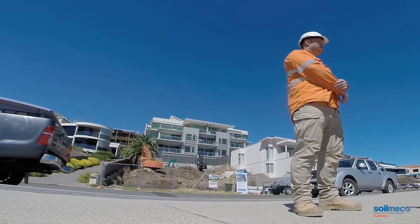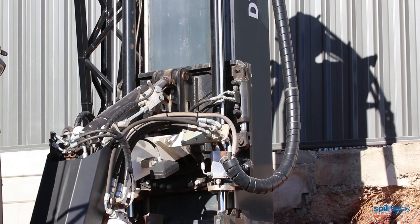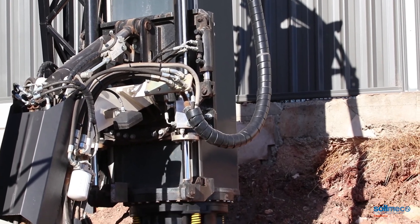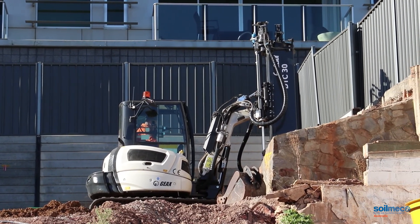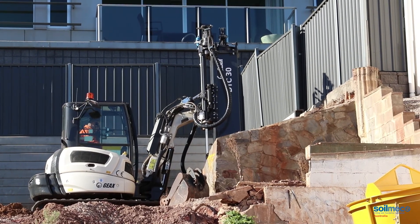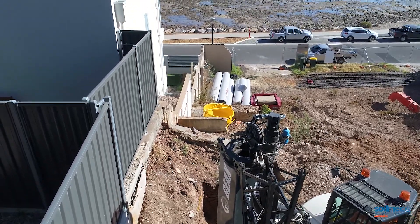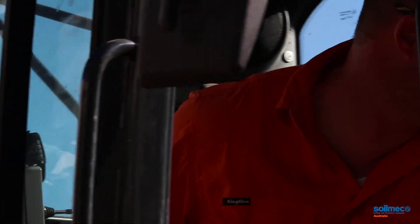So far I've drilled 450, 600, 900 and 1200 diameter with this machine. I find that the weight of the 1200 auger is pushing it a little bit on a machine of this size, especially because the tool is so much further out from the machine to allow you to slew and miss the blade. The depths I can still get — 900 I can get 15 metres any day of the week. In the right ground conditions it hasn't been a problem. The 1200 does start to push those boundaries a little bit. But 600 and 450 diameter is money in the bank — every day of the week this machine can do those diameters, no problems whatsoever. Only once you start getting bigger do you start to push the limitations a little bit.